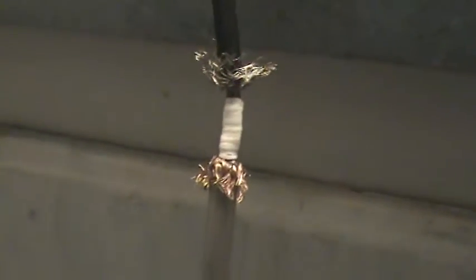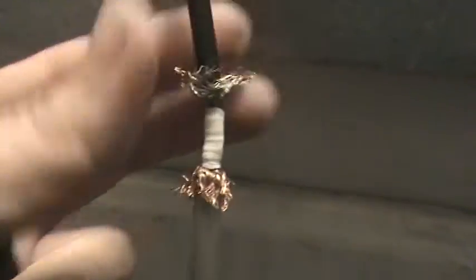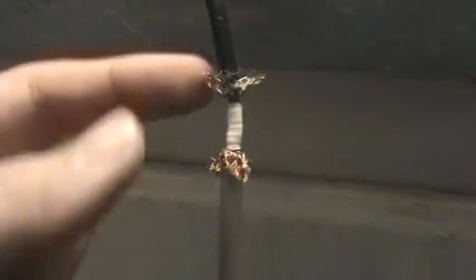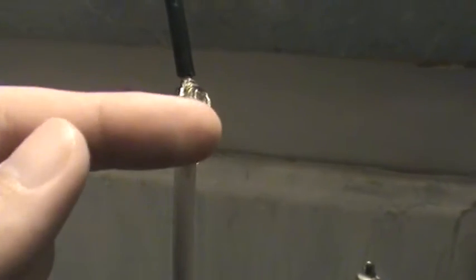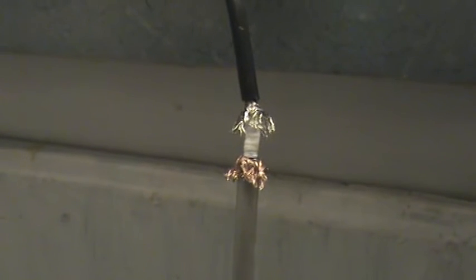What I'm going to do next is take the thinner cable. If one of the cables you're splicing is thinner, take that one first and flip it back over the thinner one on the inside. And then once you have that all scrunched together, take the thicker one and flip that over it and then solder all the way around. And when you're done with that, wrap it really well with electrical tape or antenna sealant.